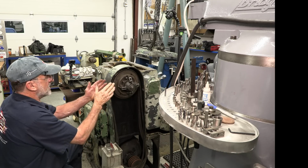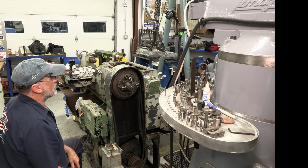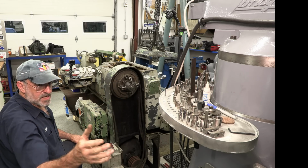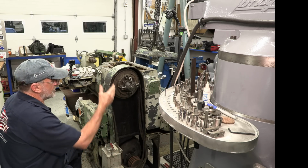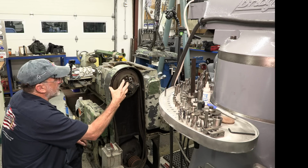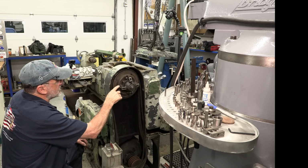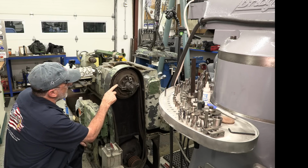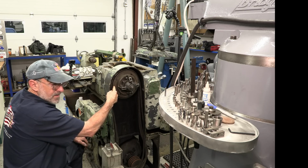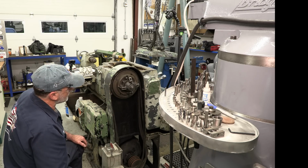I looked at the arrangement here, and it does give an exploded view, but it's an old picture of it, and it's kind of dark. But this is the same kind of clutch as on the K&T and a lot of others. It's a past center clutch, or an over center clutch. Basically you've got a spider here that's moving in and out, and as it moves in and out, it tightens between itself and the disc and the hub of the pulleys.